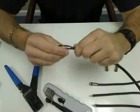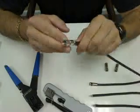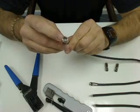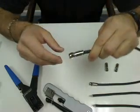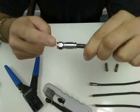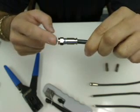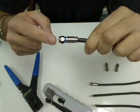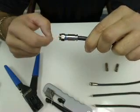You give it a couple turns. A couple things to keep in mind: your foam dielectric — or foam polyethylene dielectric — should be flush with the inside of your compression connector. A little tip I like to give is that I like the center conductor to slightly be exposed beyond the lip of the compression connector. The reason this is so important is when you apply this to either a splitter at home, the back of your cable TV, or the back of a satellite box, it makes better contact with the inside pins of your component.